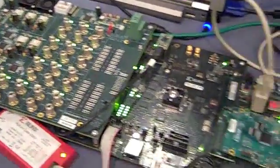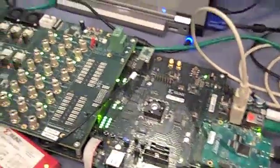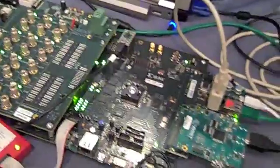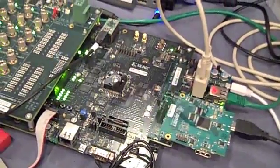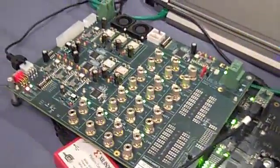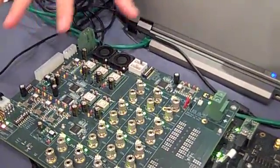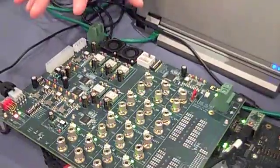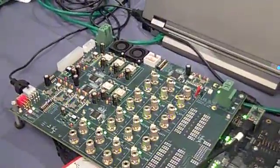So in short, quite a lot of progress in two weeks. Now these are your internal development boards? This is an internal development board, which explains some of the stacking that goes on. This power board is common to all of the 7 series testing we do internally. It's quite a beefy board because it works for the Virtex-7, Virtex-7 2000T, just like it works for Zynq and Artix in any context.